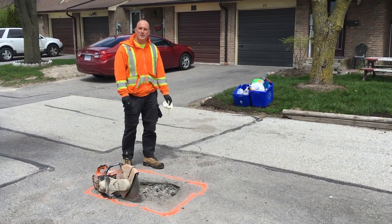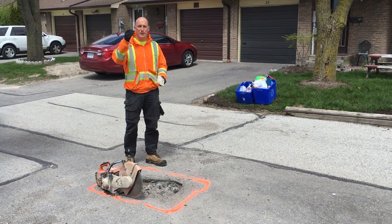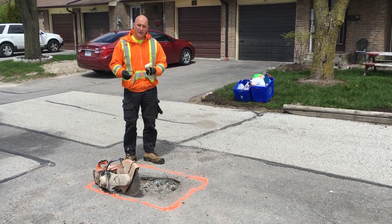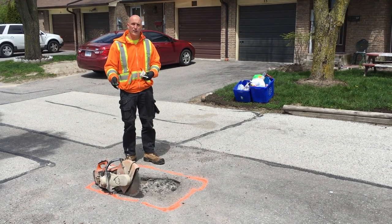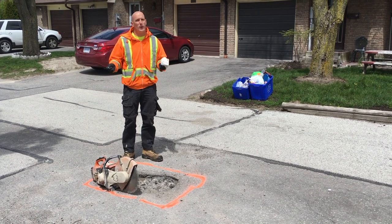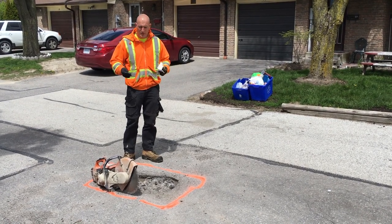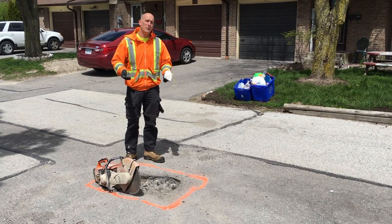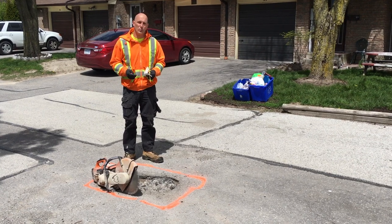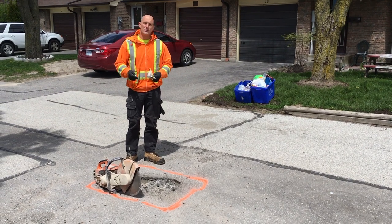Right now we're ready to start the saw cuts. Before we cut, it's very important — safety first. It's always good to have earplugs because the noise is very loud, and it's important to have a dust mask. If you're in an area where you can't use water to keep the dust down on the saw, then you definitely are going to need a mask — that's stuff you don't want to be breathing in. Today we don't have water; it's just a small little cut so we're just going to be doing dry cuts, which is very dusty. Earplugs, masks, and safety goggles if needed.